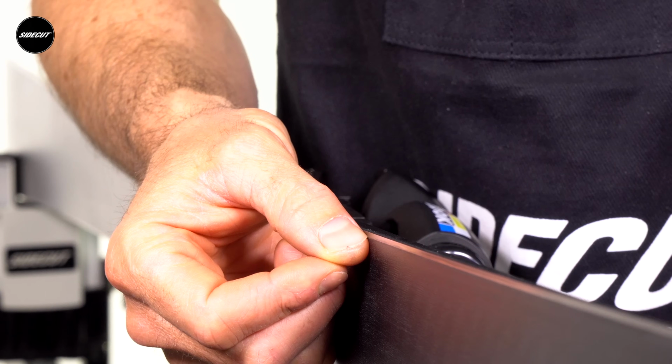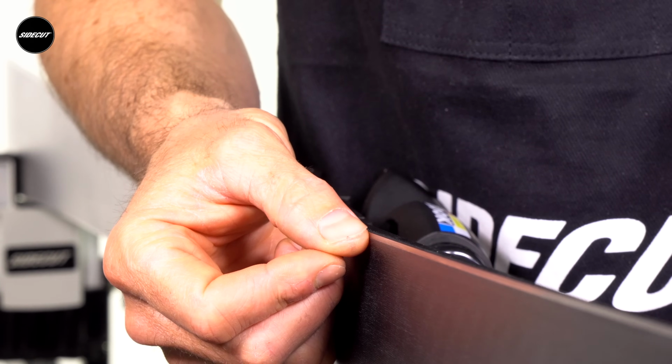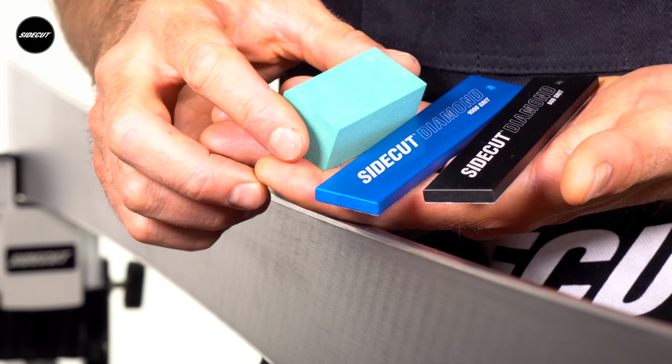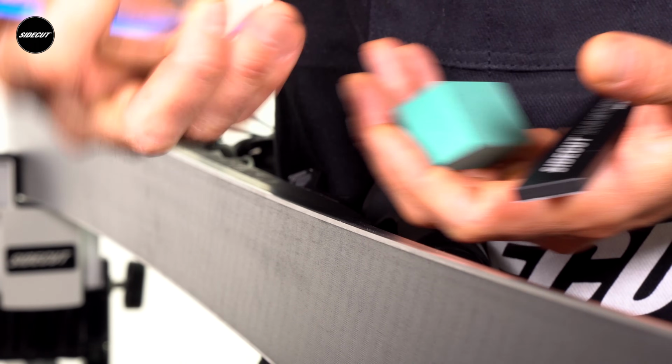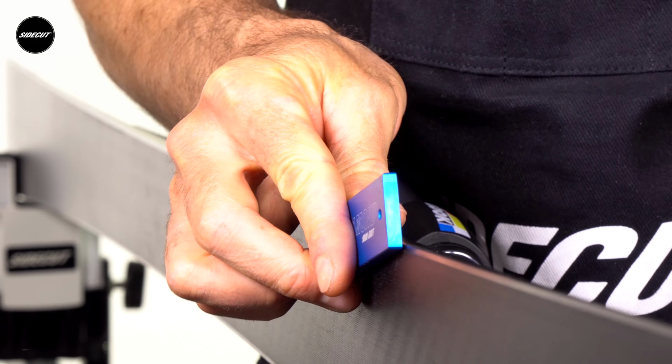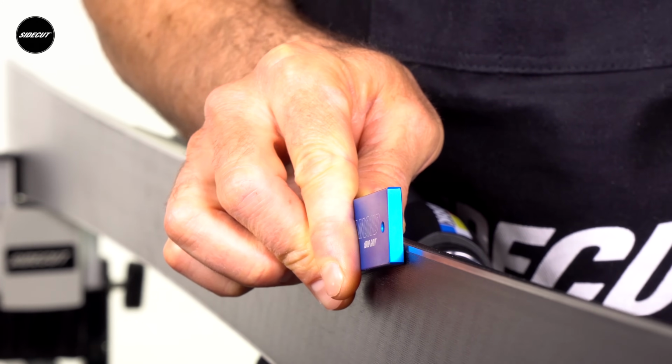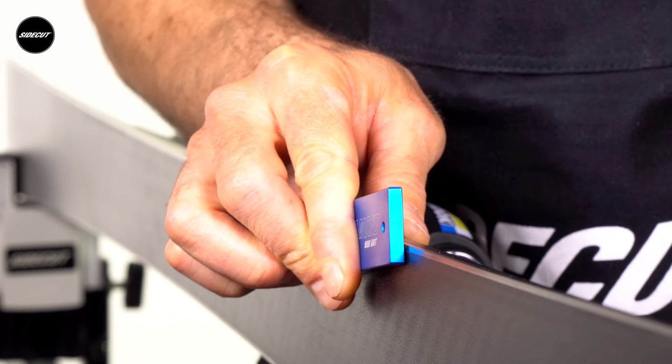After side edge filing, you can often feel a little hanging burr with your fingernail. To remove this, use either a 600 or 1000 grit diamond or green gummy. Position the stone on the base with a slight angle and tip it to meet the bevel of the edge. Touching the diamond to the edge is a very subtle move.